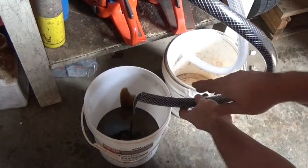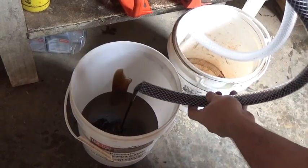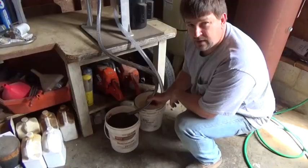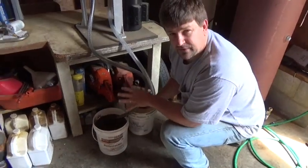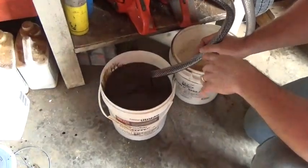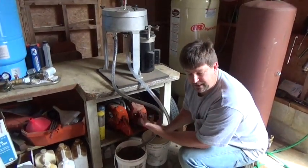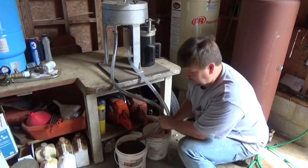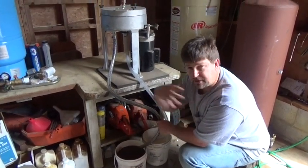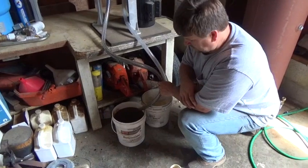We're going to experiment with the rate at which we're flowing — I don't know if I'm going too fast or too slow. This is our first batch; we were a little bit fast on the flow rate in the beginning. We're getting down to the end of our two-and-a-half gallon batch. Then we're going to shut the centrifuge off — the only way to really tell if we did anything is to see how much sludge is left, but that doesn't work until the centrifuge stops spinning because all the sludge will be stuck to the outside wall.